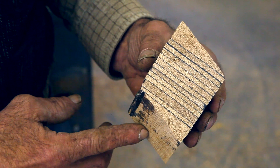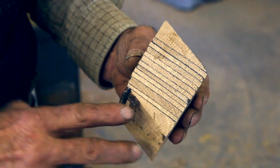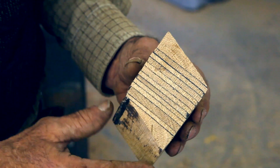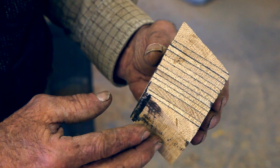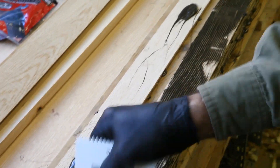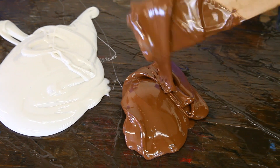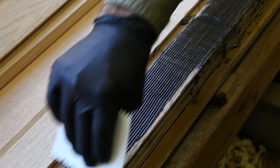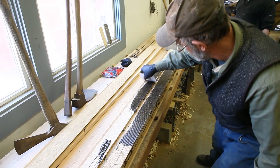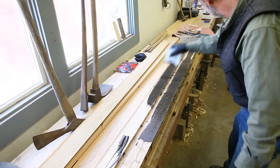Here's the cut-off from the end of the frame — you can see the beveled laminates and the stack of laminates in between. We took a piece of this cut-off, put a wood chisel on the glue line, and tried to split it apart. We can't do it — it's substrate failure when you try, meaning it rips the material apart rather than the glue line. That's how good the glue is. We're now spreading the epoxy on the laminates. It's a one-to-one mix, pre-thickened, a setting epoxy — no additives needed. We mix the two parts together and spread it with a toothed trowel, which controls exactly how much glue goes on each laminate so we're not putting on too much or too little.